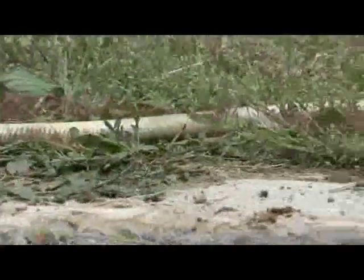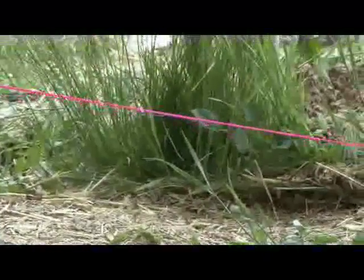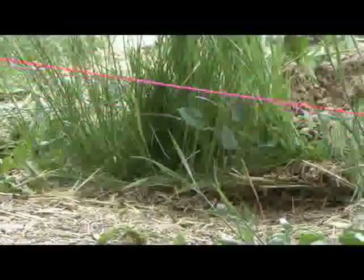When you go to make a mark that you can really read, instead of a straight line, if you do a little caret — a little V — it's much easier to get to a point and you know exactly where the point is. If you do a straight line it can be angled. Another option if you've got batter boards that are going to stay for a while is to put a notch in the top of the wood with a handsaw, so it really stays.